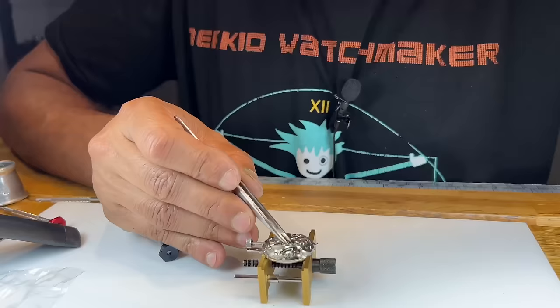So now we can assemble some of this automatic works, and this is a reduction gear and pinion. We have another intermediate reduction gear. I think this intermediate reduction gear could do with a bit of something. And then we have the two coupling clutches, one here. Another coupling clutch there. And now we can put the bridge on. Just make sure everything's free.